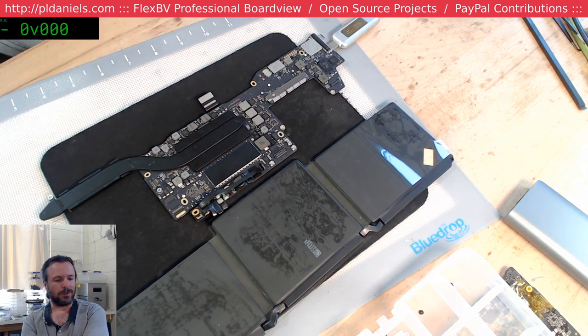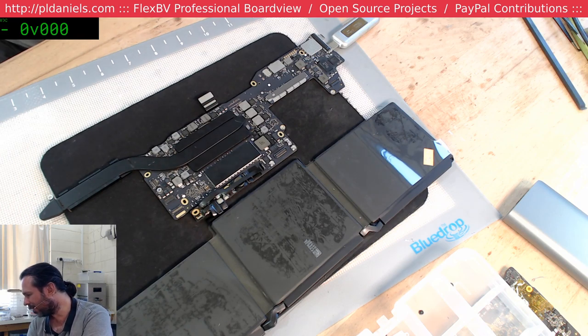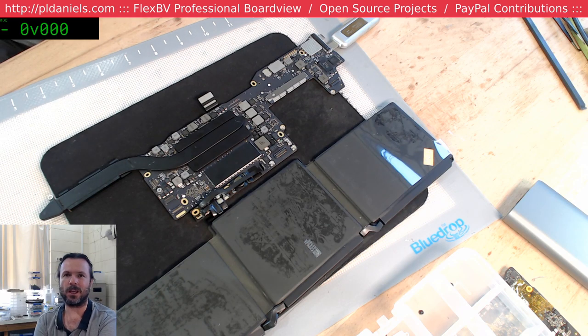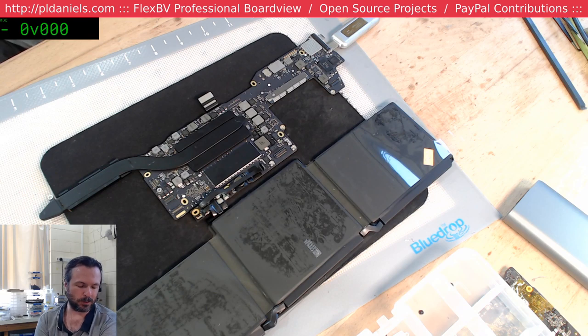Well, let this put 200 milliamp in, and at least that way then the pack can sit around and be okay on the shelf for another month or two. So it does make me wonder, with the other battery that they tried, if it came from a questionable source. Correct me if I'm wrong, but isn't the storage capacity around 50 to 70%, which is around about 3.85 volts? And they should last like that for, under normal circumstances, a couple of years without drifting too much.